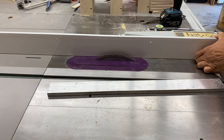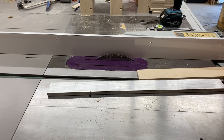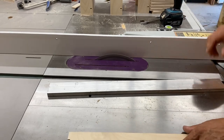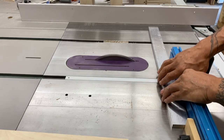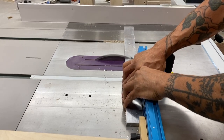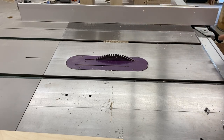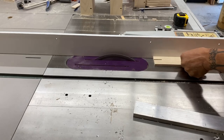Here is some more aluminum I'm having to cut — pretty substantial, I believe this was half-inch thick bar stock, about half-inch thick and two-inch wide. I just cut a chunk so I didn't need to rip the entire section. With a proper blade, it cuts really well. I lubricate with WD-40 — I have another video on cutting non-ferrous metals where I explain all that. A little bit of WD-40 will really make a dramatic difference.